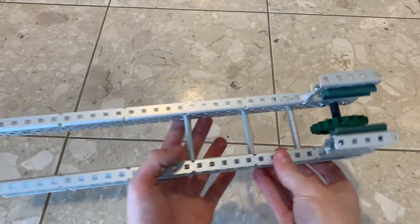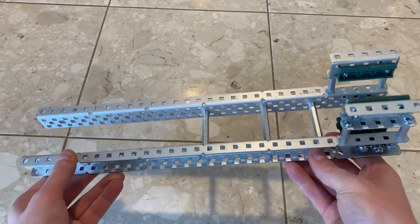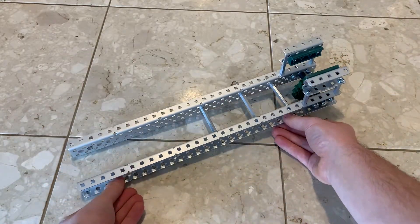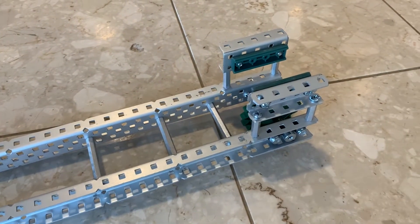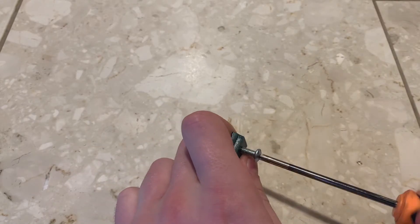To start, you'll need to make a base. Here's my base, simply two pieces of C-channel with a sprocket at the top. Attached off to one side are two small pieces of C-channel with interior slides. I'm choosing to use interior slides here because it's pretty hard to actually rip the rails from them when compared to using the exterior slides. To attach an interior slide, you simply thread a screw into the undersized holes.